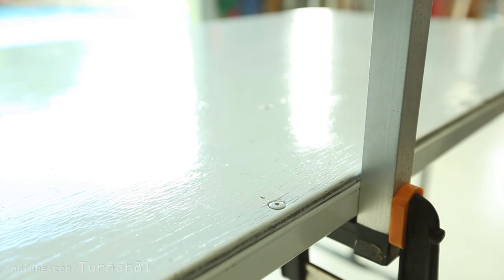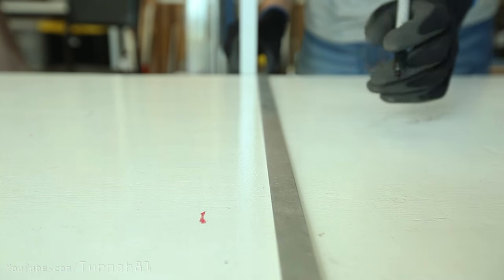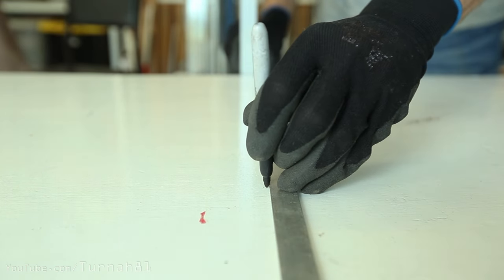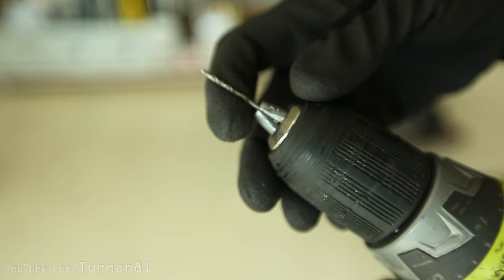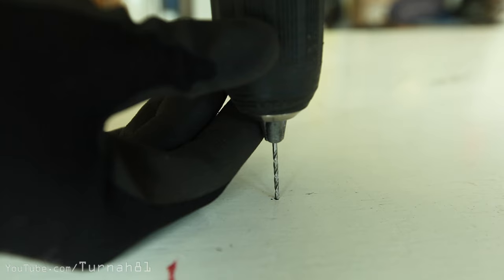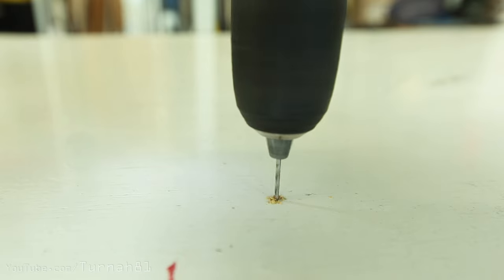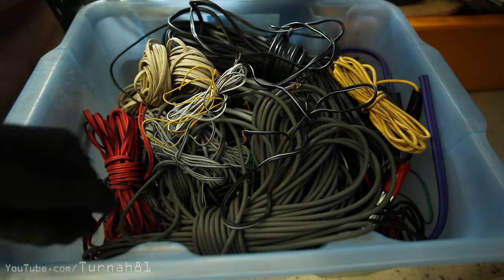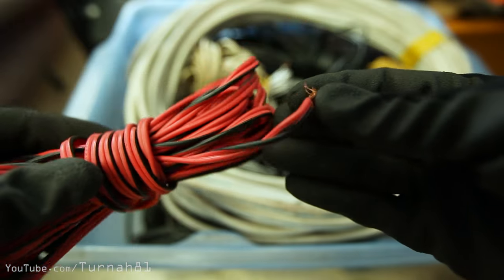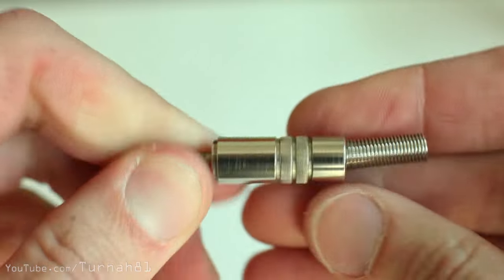Use a hacksaw to chop away any little bits of burr aluminium out of the corner so each section of tube doesn't have contact with the other piece. We now have a hot wire arm with a pretty decent reach, on par with a professional unit, and the slider fits and skates along the tube quite nicely. Grab a straight edge to square against the clamped arm, then mark the table under the end of the arm. With a small drill bit, drill a hole in the middle of the table. From the old box of random electrical wire, I've got some figure-8 cable, which should do nicely — use something fairly thick like this.